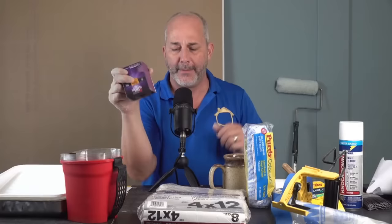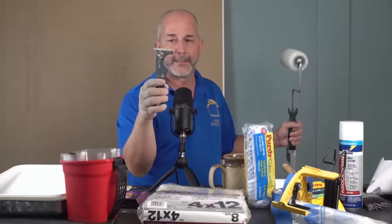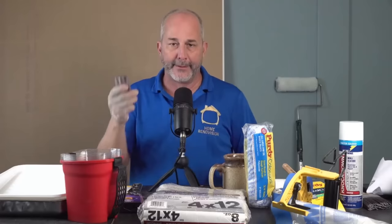Other things you're going to need: make sure you get a sanding sponge with sloped edges — those sloped edges are amazing because they let you get into corners without creating extra work. Everybody's going to need a five-in-one: it opens the can, the curve is for cleaning your brush out, and you can use the tip to punch a couple of holes in the rim of the can so paint drips back in. You're also going to need a metal razor blade — spend the extra dollar, go from three to four dollars and get the metal version. It'll clean stickers off windows and be a lifesaver.